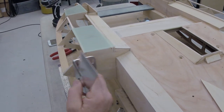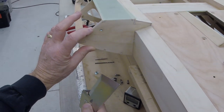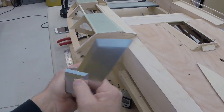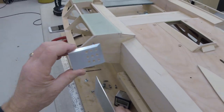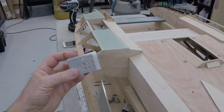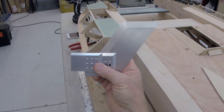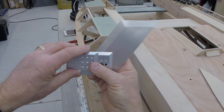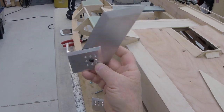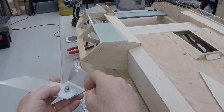So I want it out within reason. If I go out too far, the area where I can mount it becomes really narrow and I wind up making a really narrow bracket that will flex, all right? Here's an example of an eighth scale bracket that I made. And I'm making my gasser one wider because the boat is heavier theoretically and I just think I need a little bit more structure. If I decide that it works awesome and I can get away with less, I'll cut it or I'll make a new one, don't care, all right?